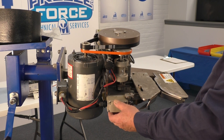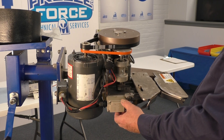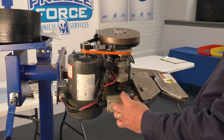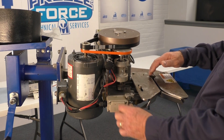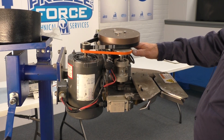This is the micro switch, which activates the clutch. The terminology is micro switch and micro switch rod. The rod moves when the bag is inserted and tells the machine that the bag is in and to operate the micro switch to operate the clutch.